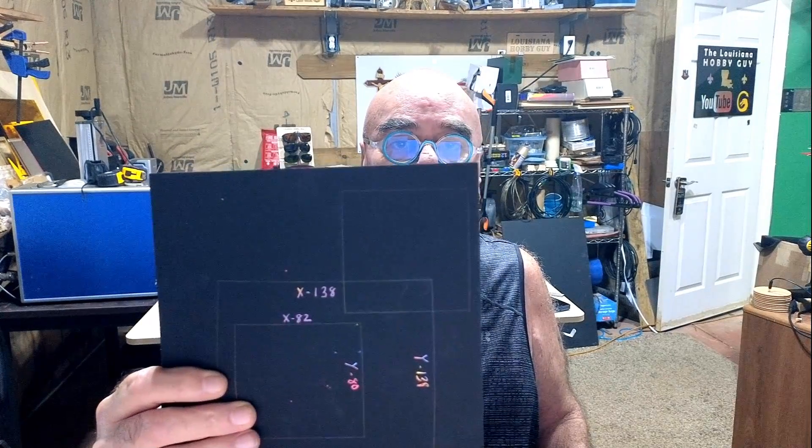That last square is spot-on — it's square now, no bulge, no skew, no problems whatsoever. We've finished the calibration. The video took a little longer than anticipated, but we went through all the steps. If you need to change your lens, don't be afraid to do it — LightBurn makes it so easy that anybody can do this. Feel free to buy extra lenses; get a 75mm lens for deep engraving on coins. Just follow this video to set them up. I hope you enjoyed it, and I'll see you in the next one.